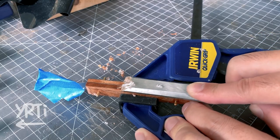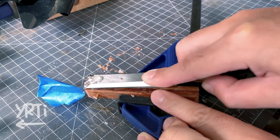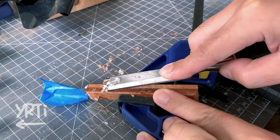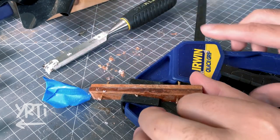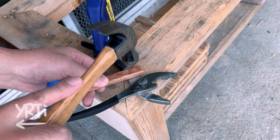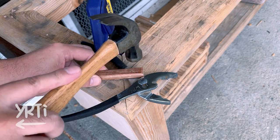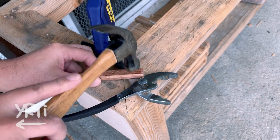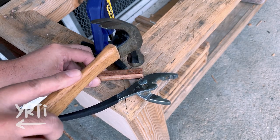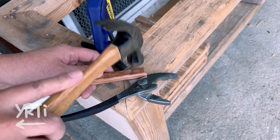This is a few hours later and the epoxy isn't fully cured. At this time I cleaned up the excess epoxy with my beta chisel. The next day the epoxy was fully cured, so I trimmed the pins and did peening. I didn't know how much I should smack the pins, so I did it only a little bit, and then filed off the excess part of the pins.